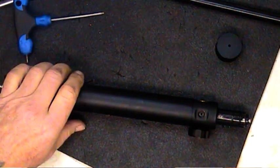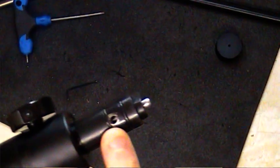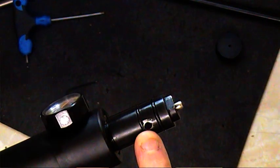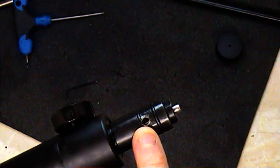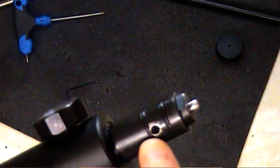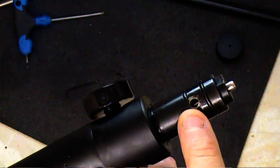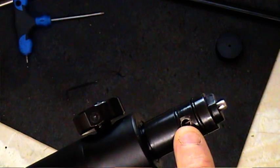Now, tuning wise, as with most, it's to do with the ports. So you'll look at the main firing valve port and it'll be quite small. So 4.2, 4.5 mil is a maximum. Ideally 4.2, because you start getting into interfering with this front O-ring if you start going any bigger than that, really. So basically 4.2 mil is your max.